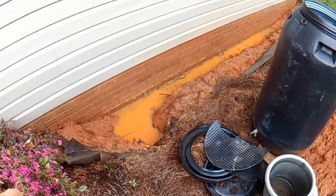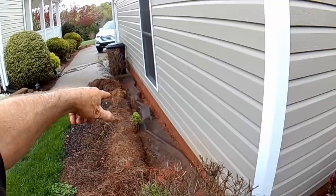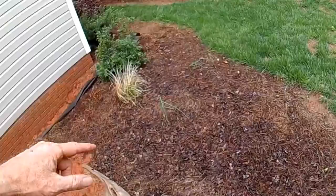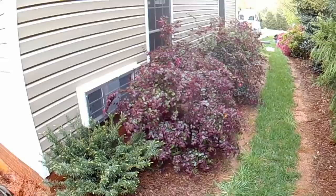You still have to solve the water problem. What we're going to do is excavate, parge all along this wall, and dig down to the footer, starting right there at the sidewalk. Remember, footers are level, so we're going to bring that water all the way around and discharge it clear out at the street — all the way out front. We'll need to remove all these shrubs; we'll try to save them but can't guarantee it.